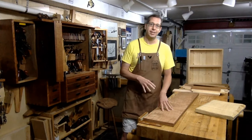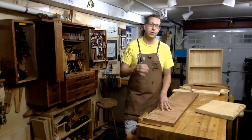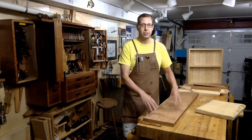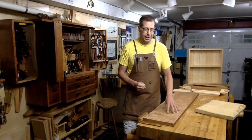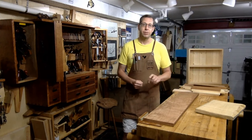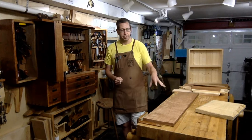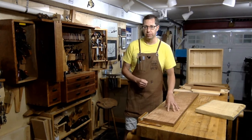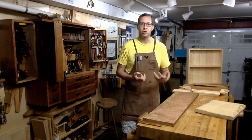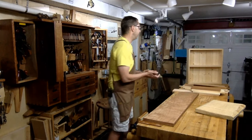And this goes back to what I said at the outset. Because I don't have a board referencing its table saw surface or a bandsaw surface or what have you, it's not important for that to be flat. It is important, however, to think about what we'll be referencing off of that surface. We talk about reference surfaces a lot, especially when it comes to joinery and casework.